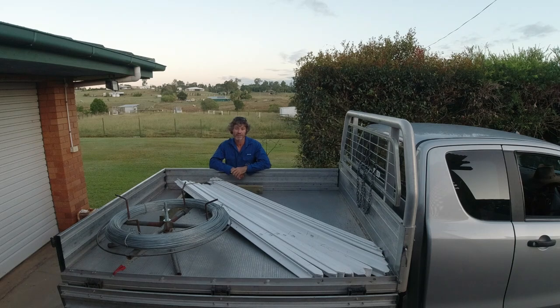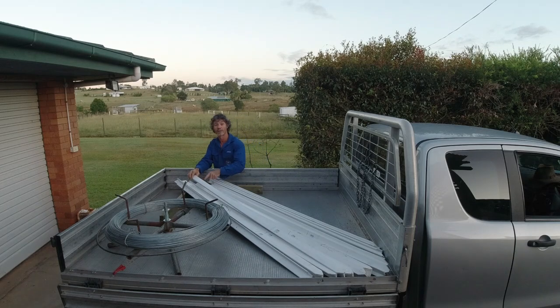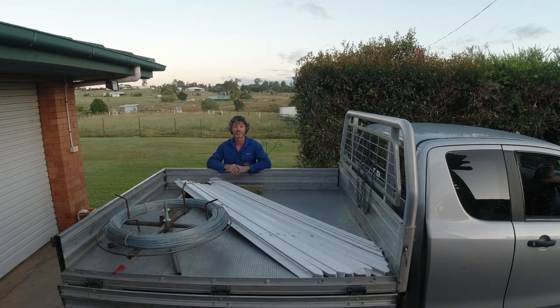So today I plan on erecting my first bit of Timeless fence along my property. I've got those corners in. Now it's time to put a straight run in. It's about 300 metres today, so I'm using the bad boy of the Timeless range, the 2 1/8, 6.5 footers.